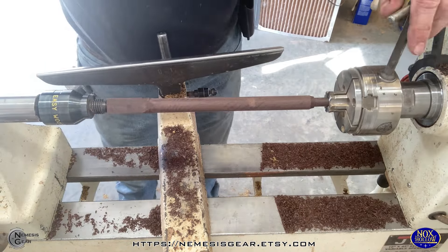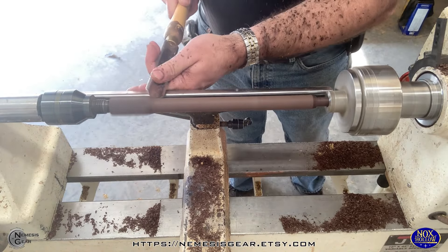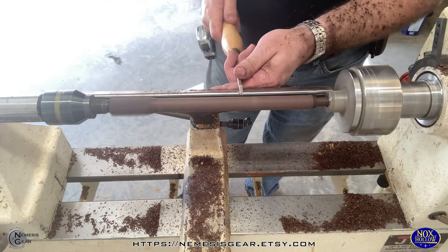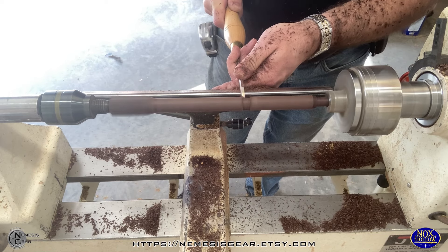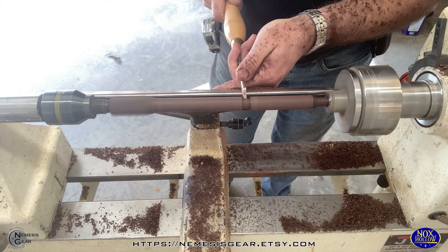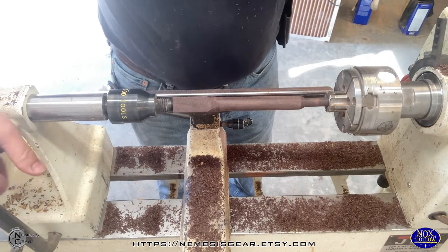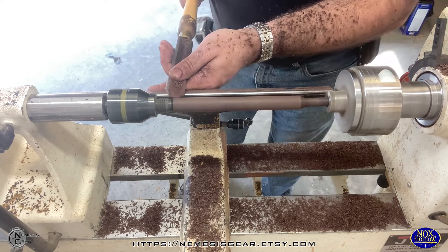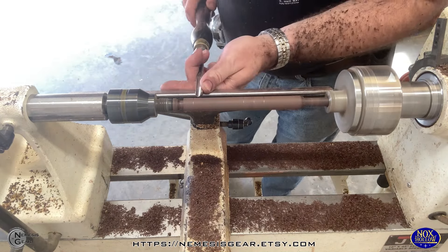Katalox is one of the more difficult woods to turn, which is definitely one of the reasons I feed these up inside the chuck jaws — because this thing chatters like mad. It's very hard and dense, and even with freshly sharpened tools I'm still getting a lot of chatter. So basically I'm getting it turned down to about the size of a Sharpie, feeding as much of that into the chuck as I can, then finishing getting this rounded shape done and marking out the general handle area.